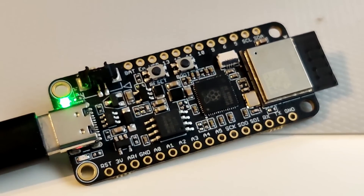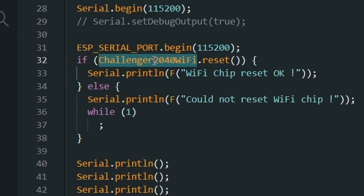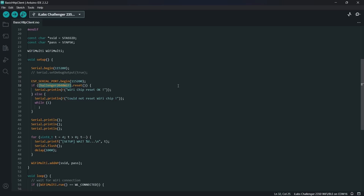There's the LED flashing. Now let me show you how to use the Wi-Fi. At the moment it uses a special set of Wi-Fi commands — not the standard ones from Arduino — specifically designed for the interface to that C6 chip. We'll run this now: it will try to connect to the Wi-Fi, connect, and then try to get an ASCII logo text file from a URL, and display it in the serial output.